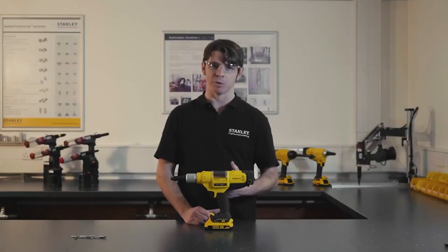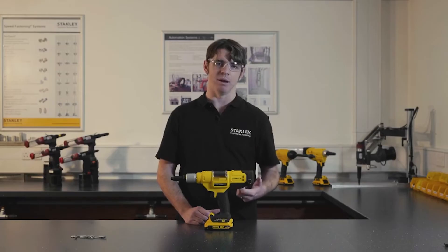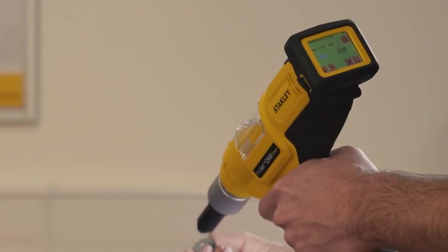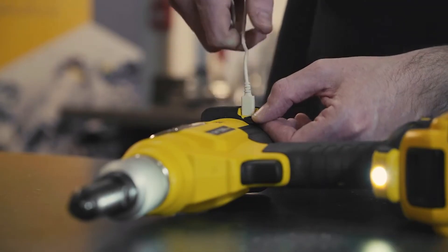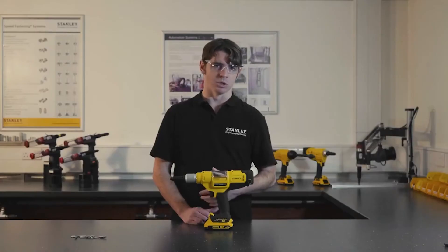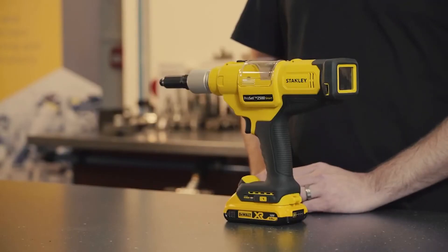This tool, as well as being maneuverable around the application, will give you that live okay on the screen to show that the rivet was placed. The tool itself is Wi-Fi and Bluetooth enabled — you can also connect via cable to your computer to download your results, or connect via Wi-Fi to something like an app. This can hold up to five hundred thousand pieces of data.